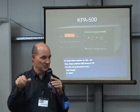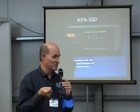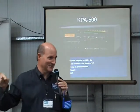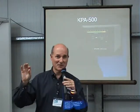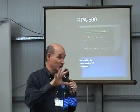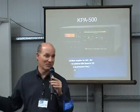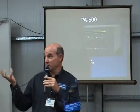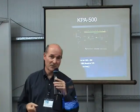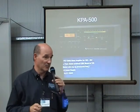I mean, you can take it to a usable level. You put the antenna on, you wouldn't hear it in most cases. But most guys take the antenna off and tune 160. If they hear any noise at all, it's a bad thing, right? So it wouldn't have solved it, this is my opinion. So we did a linear supply. Simplicity itself, it's very easy for anybody to understand and repair if they need to, and it's quiet. I had zero problems with it. We use a toroidal transformer, and it's very efficient from that standpoint, as efficient as those get. We don't generate a ton of heat in that supply, so it works out real well.